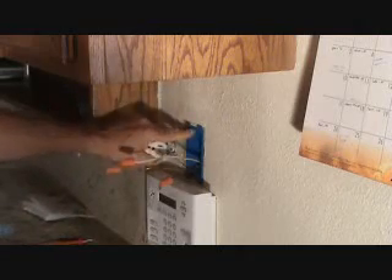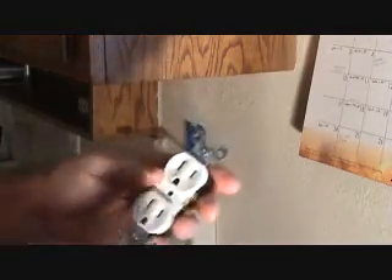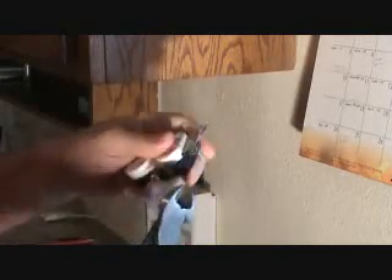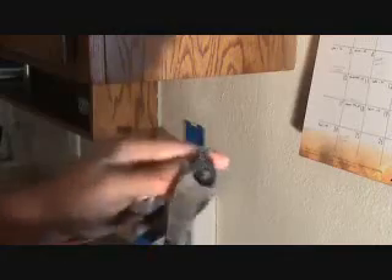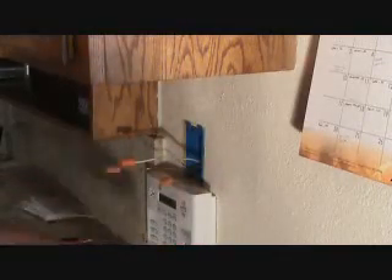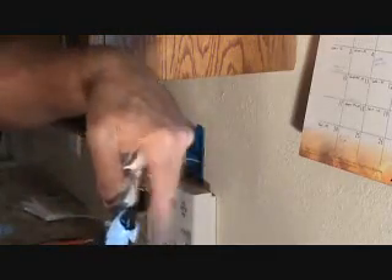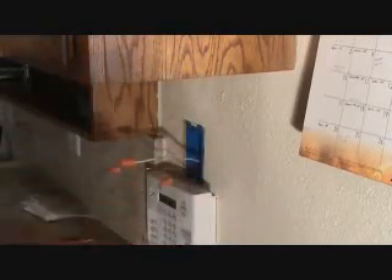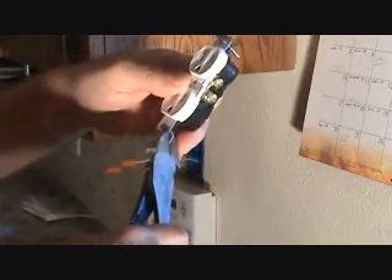Because this is a cut-in plastic box, we're going to cut these little tabs off. There's a little score mark right there and I'm just going to score it a little bit more, then bend that off. I'll do that on all the ends — I can turn it around and score it there. I find if you score it a little bit more it bends off easier, just grab it and twist and it comes off.